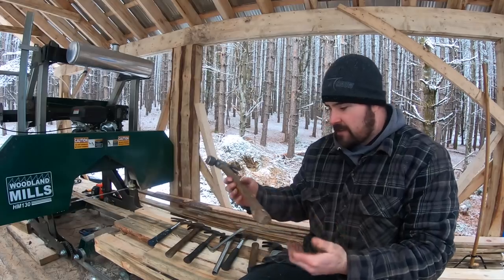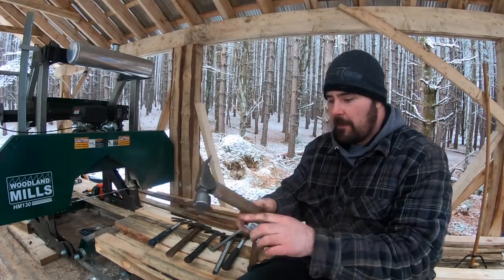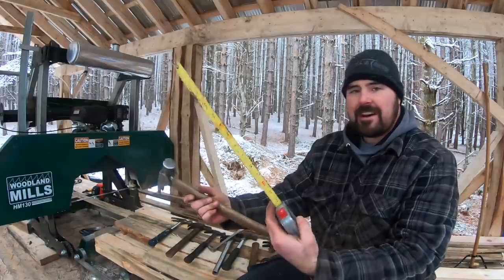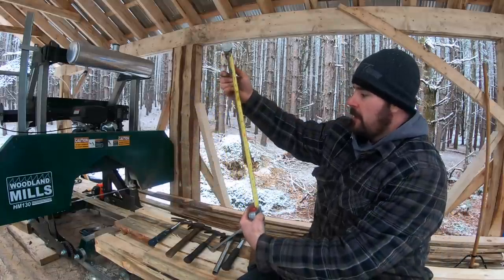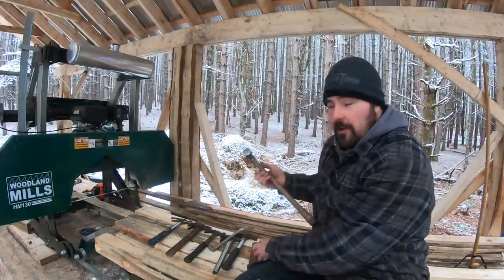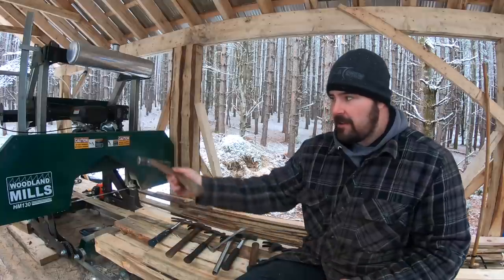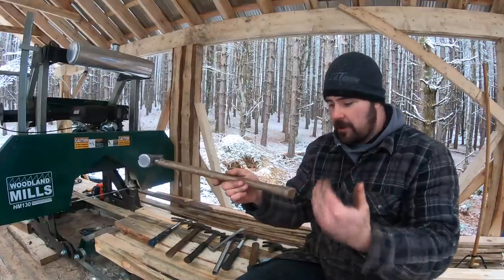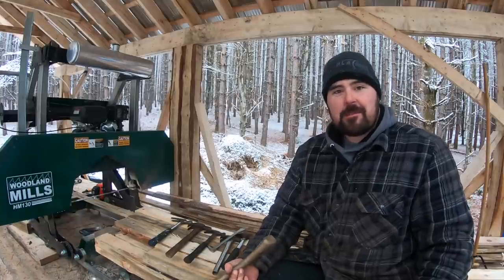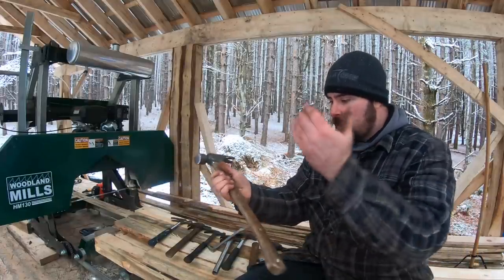A steel cat's claw is perfect for pulling nails. Another cool feature that shows Stiletto cares for the user: if you push your tape measure on the underside of the face and line it up with the bottom of the handle, it measures exactly 16 inches. That's what a lot of walls are framed at, so you can do a quick reference check — just rest the face on the edge of one stud and see if it reaches the next. It's a handy ballpark check.